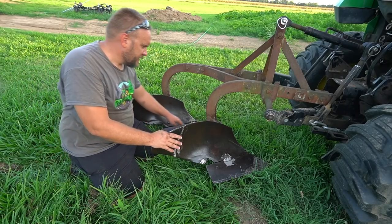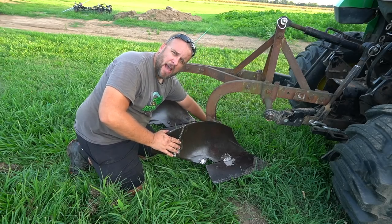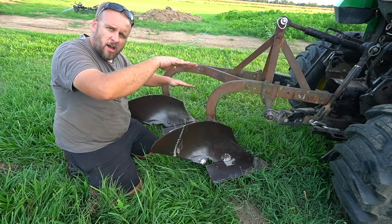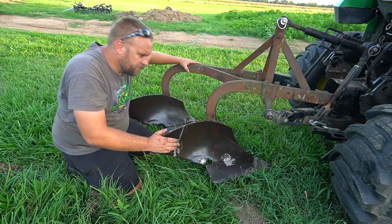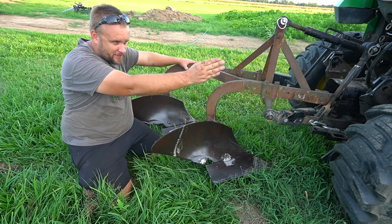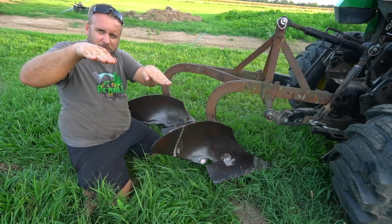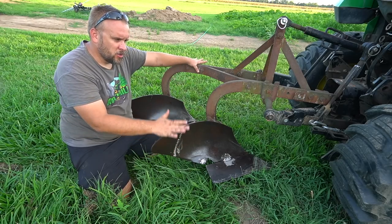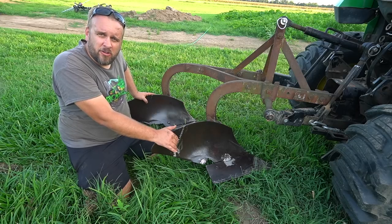It's going to be hard to see on camera, but a lot of people were concerned about my side-to-side height difference. Right now the point on the back plow is touching the ground, and the point on the front plow is about 2 inches high. Comments said I should lower that front one, but I don't think so. After your first cut, on your second pass this wheel drops down into the furrow from the other plow, and now you're level. On the first pass, you want that front one a little higher, and right now it's only 2 inches — so I don't think that's a problem.